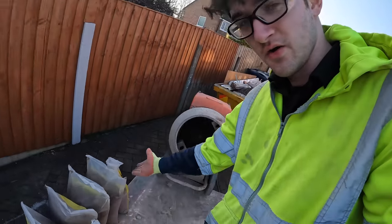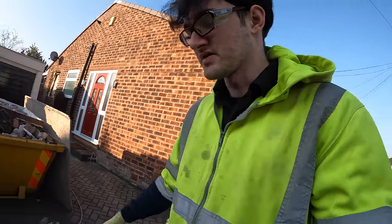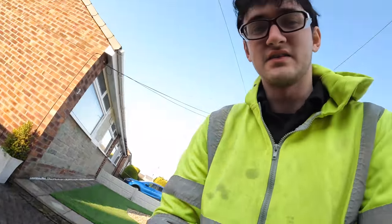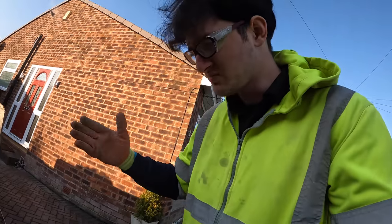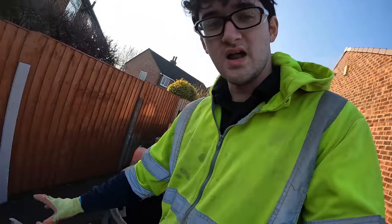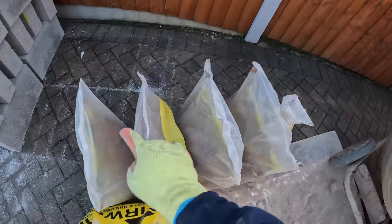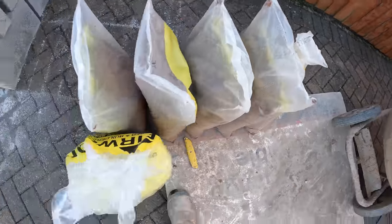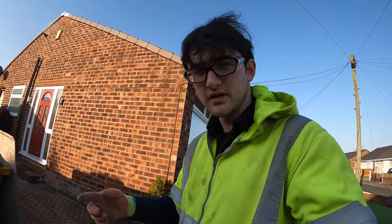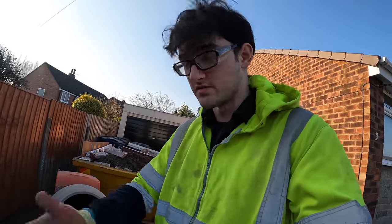Right, and as you know, we're back to our standard mixers with our red sand, and obviously not in ton bags now, so we're back to our Fairwoods bags. So it's getting back into that old system of things. I was thinking, where's my gauging bucket? I don't need them now with these bags. Our new gauge, if you will, is a full mix is now 4.5 of these 25 kilogram bags to a full bag of cement. They used to do them in, I think, 40 or 50 kilogram bags, but they've dropped it back down to 25 now, so that's why it looks like there's more sand. It's because they're in smaller bags.